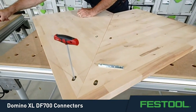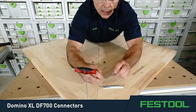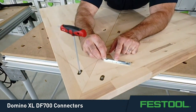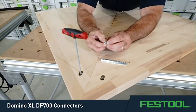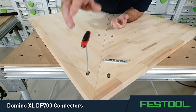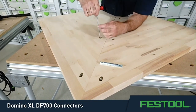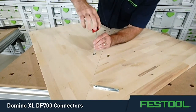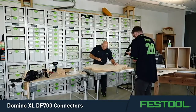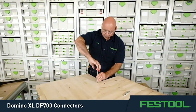Okay, this acts like what we call in typical woodworking joinery a draw bore. See this screw right here? It is sitting right here. So as I tighten it in, it finds its equilibrium because that's conical. Look, check this out. I've already tightened that side. What I always wanted to know when I first saw this is how much does it draw together? And this makes a really tight joint. And you'll see as I start to close this joint up how it all pulls together. And these are wicked strong. Cool.